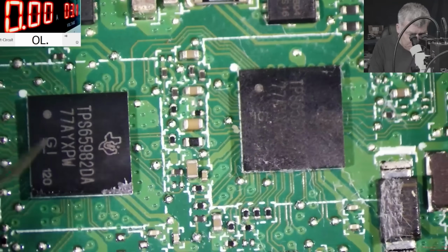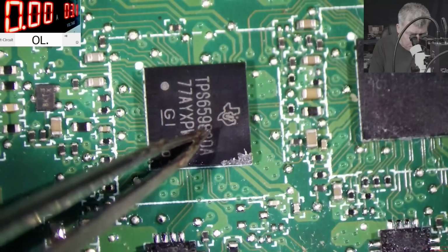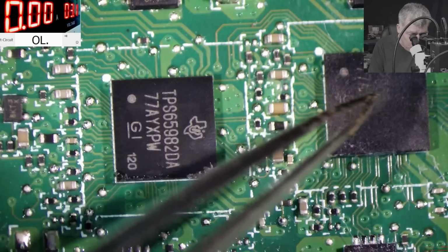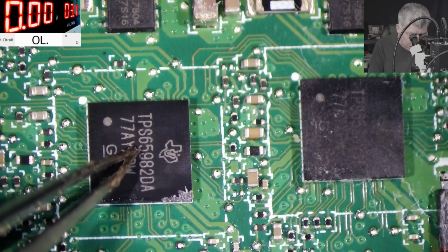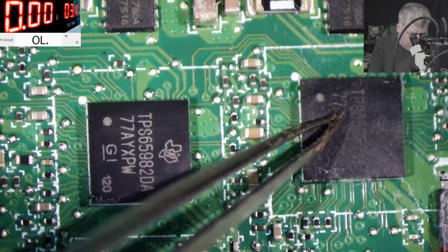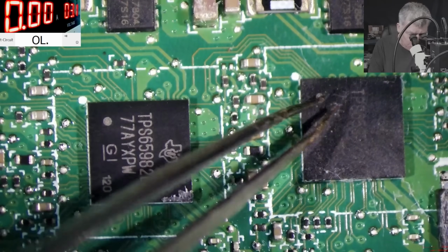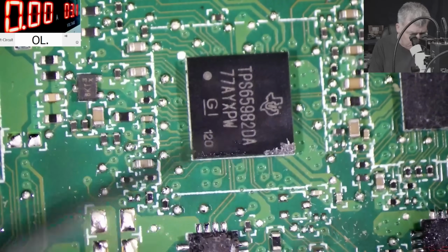So we can assume both chips are generating LDO voltage, but this one being shorted, the voltage generated from this chip is getting sent to ground by this chip. Or having two chips, but only one has LDO? Nah, it's impossible. Because if I'm using the USB-C with this, those are for 2 ports, so I should have the LDO voltage from both chips. So I believe we should remove this chip.